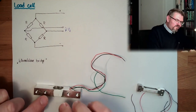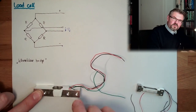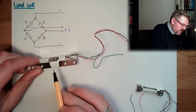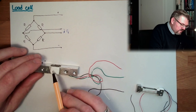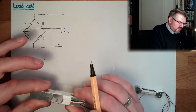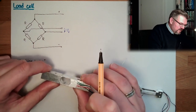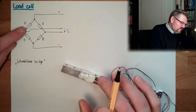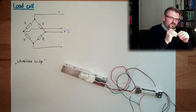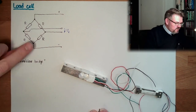Because how this is working exactly, I'm explaining. There is a series of videos, or there is a video about stress measurement. I'm explaining this. Those strain gauges, they are located under this protective film here, and this protective cover. And actually what they measure is the deformation of this element. Due to the load, this element will be deformed. And the strain gauges are very exquisite, they are very tiny and so on. And if you just pull them apart, the resistance will change. So this resistor will change, this resistance will change.